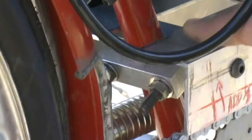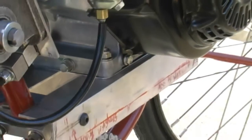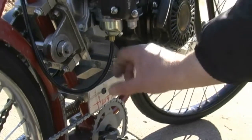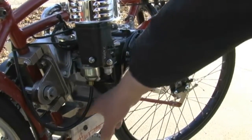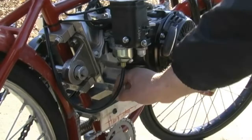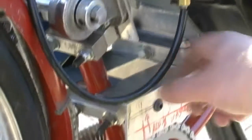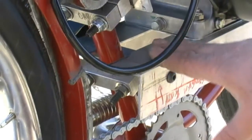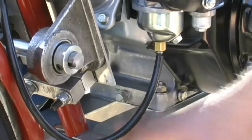You can see it's cut out at three-quarters of an inch, then I split the piece of aluminum and run your bolts through it so that everything registers back together. You put it on a pivot mount so it'll find every angle you could possibly think of in the frame. It's also good to split it because if it needs to be spread or add spacers — in this case I did add a spacer behind here — just to get the motor mount exactly where you need it.